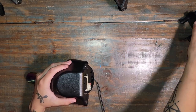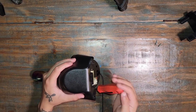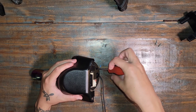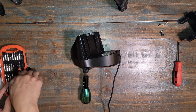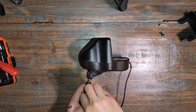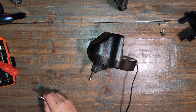On mine there's a holding nut on top of the lever that screws in — that stayed on the lead screw, so I had to manually hold it while I unspun it. It took forever and you have to do both sides. Next, use a Phillips and unscrew the two screws holding the table clamp mechanism, then pop that piece out. Underneath there are two more screws. On the bottom there are four black screws — a magnetic screwdriver really helps here. Then you need an allen key to remove the shift knob.